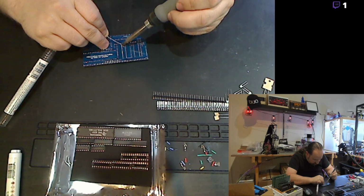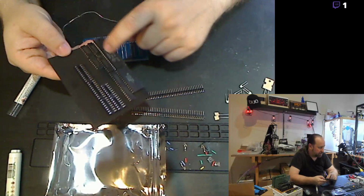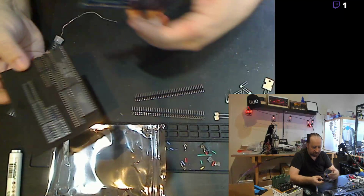And this kit build too is pretty simple. Really, the chips that it comes with are the actual video controller chip, the RAM chip, and then just a couple of little logic chips for interfacing to the actual computer with I/O ports. You actually send data to the video card through I/O ports one byte at a time, the hard way.